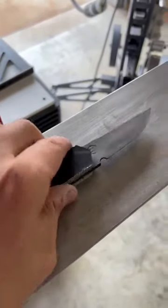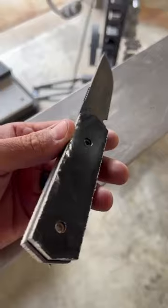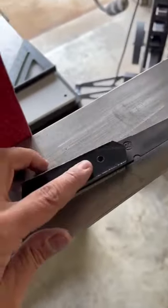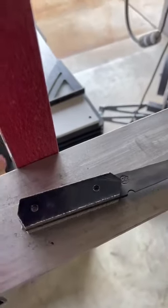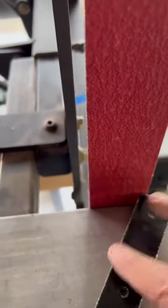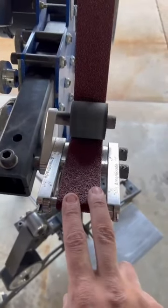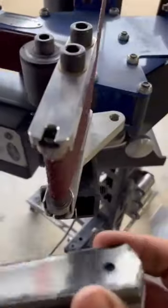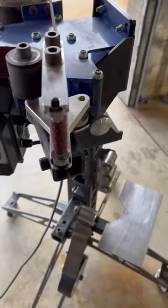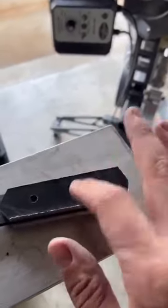Here I have my handle attached with the hardware. I'm using spare hardware because when you shape your handles you're going to nick the hardware during final shaping. I'm going to use a mix of the flat platen — to square up the body of the blade on all sides — and my small wheel holder to do some vertical texturing. If your grinder can't go horizontal, you can do it with hand files. I'll be using 36 grit and 80 grit, because I want to leave the micarta nice and textured.